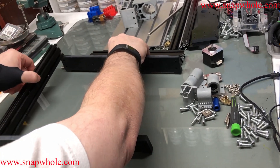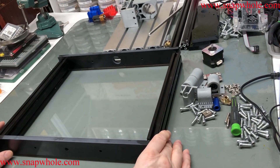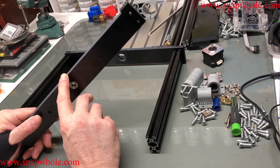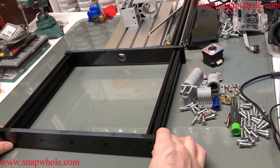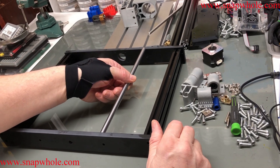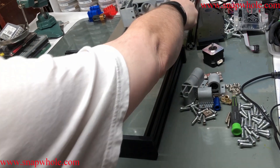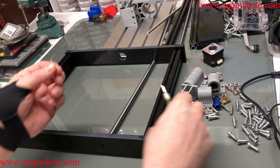Here's the basic design — it has little feet. The material I used to call Bakelite, but now it's some type of plastic, a fiberboard composite. The linear slides go in here and that's where the build plate slides back and forth. There are long ones and short ones: short ones go on the bottom, long ones go on the gantry. The screw holes are four millimeters.